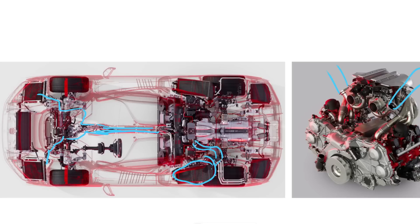I think the main water circuit is at the front, and then somewhere along this line the various coolers are doing things like cooling the battery and the front electric motor. The rear coolers could be doing a whole bunch of different things — there's a lot of smaller tube plumbing coming from them, so these could be doing transmission cooling, motor cooling, or battery cooling. The key point is that we've got quite a few different cooler locations whose ducting we're now going to discuss.